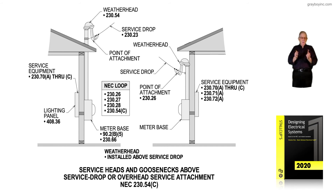We highly recommend that you review the relevant code sections. Once you review them as an electrician, you usually remember them. We write down in our code book the ones that pertain to installations concerning service risers and terminations through the meter base to the equipment. Be sure to read NEC 230.26 point of attachment, 230.27, 230.28, and weatherhead location under the general principles of 230.54C, without applying any exception.